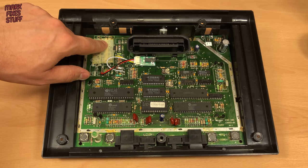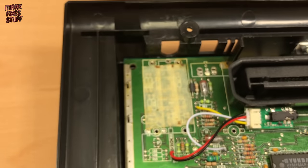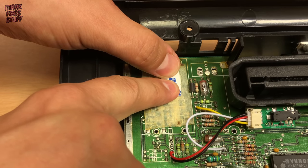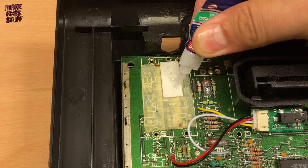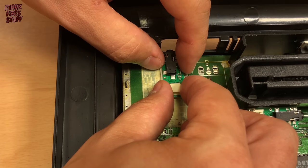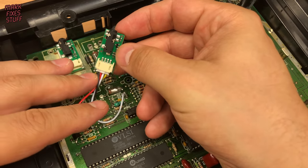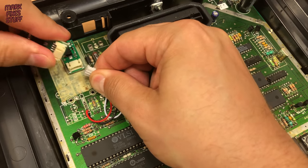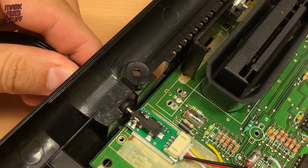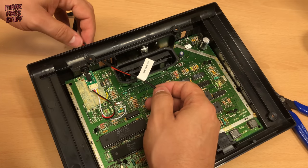The fingers in the slot are looking nice and fresh. With the main board located in the case, we can position and mount the composite mod board, lining it up with the old RF output hole. A few people have said that the supplied sticky pads come away over time, so I'm going to reinforce this one with a smear of super glue gel. I don't want to glue directly to the board, so I'm gluing to the well-adhered masking tape. The mod sits a bit wibbly — it's not quite close enough to the edge, so the quad-pole jack is a bit tough to get in. Whilst we let the mod board glue set, let's get the power socket mounted.